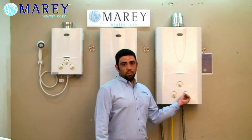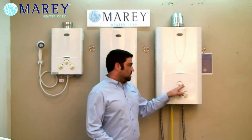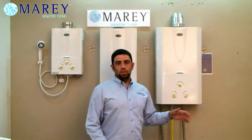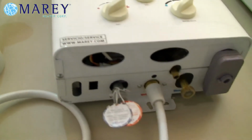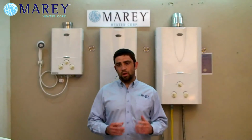Also, you can adjust the water flow through the unit, which will also change the amount of heat. If you have this set on winter and the burner set on high and the water flow set on low, you're going to get the hottest water temperature out of it. We highly recommend that at minimum you have help from a plumber or a certified gas technician to install these units, unless you're very familiar with installing gas appliances.